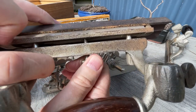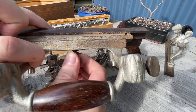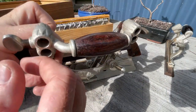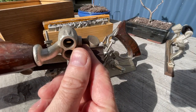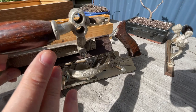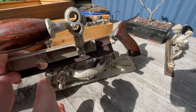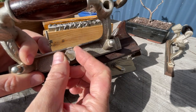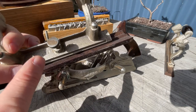Other than that, the planes function and operate pretty much the same. You have a micro adjuster which enables you to adjust the fence with a single screw just a small amount. After you've positioned your fence by bolting it onto the rails and locking it in place — getting pretty close to the right position, pushing it up against a timber and locking it in — this enables you to adjust just slightly. That's available on the 45 as well.